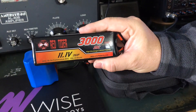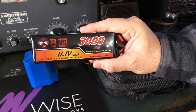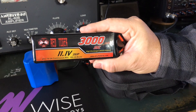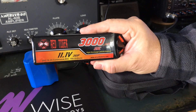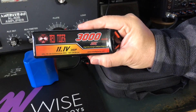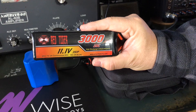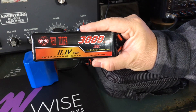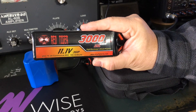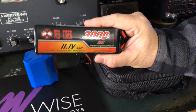I've not been able to kill this thing. You're not supposed to let these discharge under 3 volts per cell, so in this case I wouldn't want to go below 9 volts. But my plan is to never let it go below 9.9 volts — 3.3 volts per cell — as a safety factor. The good news is the MTR radios, these LNR Precision Mountaintoppers, at least the newer versions, have a digital readout that tells you what voltage level they are being powered by. So you just keep an eye on that. My plan is when it gets to 10 volts, I'll just shut her down. The radio is a miser — it just doesn't take a lot of current. I've literally not been able to kill this battery on a summit.